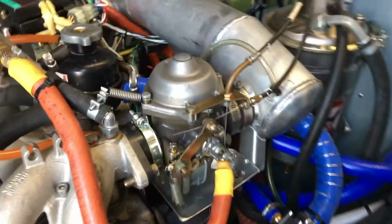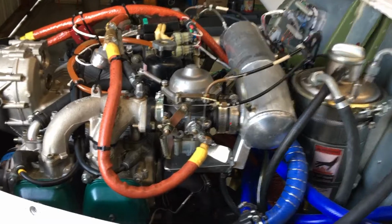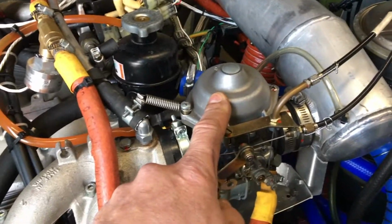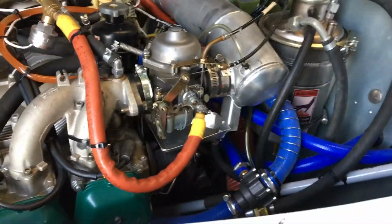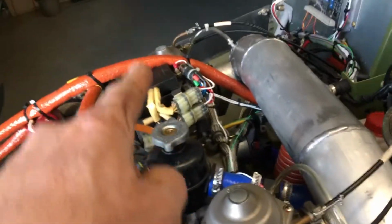And rest assured, it's going to idle just beautifully now that I know that those idle jets were nasty and needed a little cleaning. So if this was done about 4 years ago, imagine what your idle jets might look like. You could just start with at least this left side carb because it's very easy to get to. Pop it out and inspect, and if it is not pristine, clean it out with a wire brush bristle and get it reinstalled again, and then go after and do the other side. A little more involved, but not a big deal. It takes about an hour.